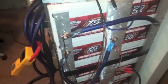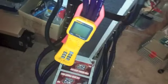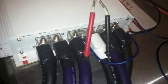We got some Toolmaker bus bars wired up. We're using all Sky High Car Audio 2-aught OFC wire, 2-aught copper lugs, and our 4-aught Anderson connectors. I've got my Fluke 355 here. We're going to grab a couple clamp numbers. I'll explain a little more about that later. And here on this M1S, we have triple 1-aught power and grounds. We're using our Toolmaker 4-aught to 1-aught reducers here. Head unit's wired up, got our Dropping Hertz RCAs, and then over to our dyno.